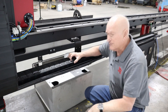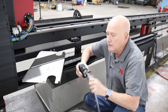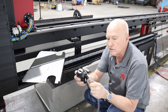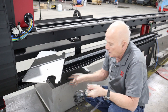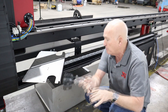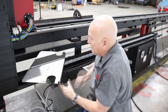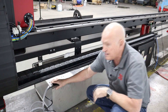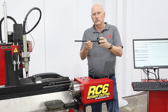I'm at the back side of the RC6 cutter. First thing we need to do is remove the lid off the tank. Using the included barb with the pump, I've attached it to our vinyl tubing using a clamp. These are designed to press into the pump, but if you're concerned about it coming loose, a little bit of instant glue and you're good to go. There's a fenced-off area inside the tank in one corner — that's where we place the pump. We now align the hoses and cord so that when we replace the lid, both items come out of the tank heading in the right direction.